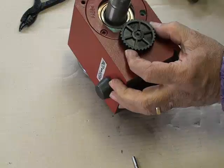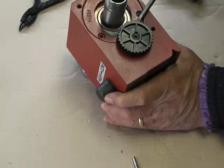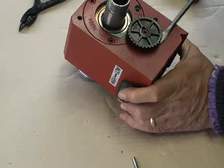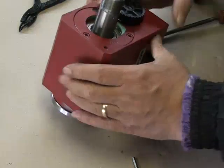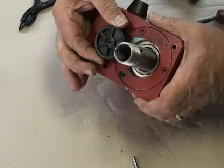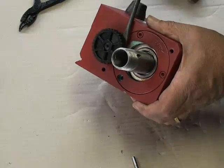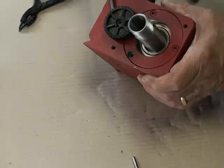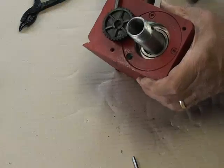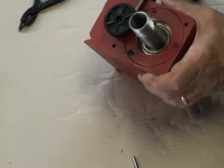This gear is quite tight, so you have to gently prise it off with a blade, a bit at a time. You'll see it starting to move a little bit — it doesn't just pull off easily with your fingers, it's actually quite tight on the shaft. Gently push it all the way around; it's slowly coming out. They're not very expensive if you break them, but you don't want to break it if you can help it.